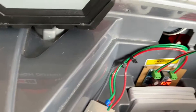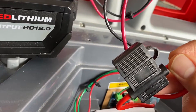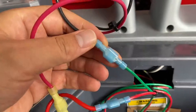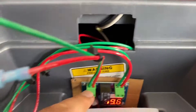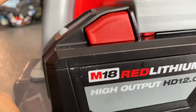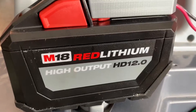From there it's wired connected directly to an inline 40-amp fuse protector — I think I got this one from ML Toys; I'll put links in the description for all these items. Connected with a couple quick disconnects, that runs directly to the power side of this controller here, which is a digital low-voltage protector disconnect switch.